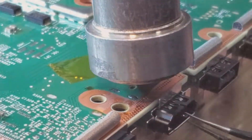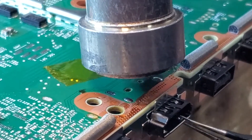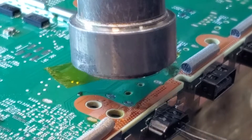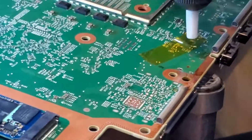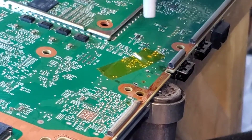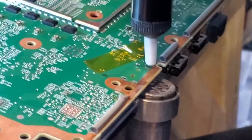The solder is starting to melt in there. I'm not going to rip it off the board — I'll let it come off naturally. We're just cleaning out the holes right here. I'm putting a little bit of heat on the bottom and then I'm just using my solder sucker to suck the solder out.